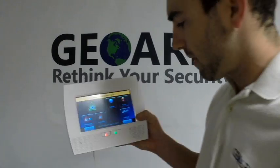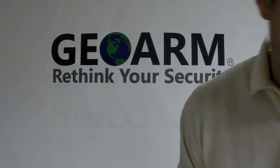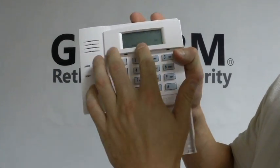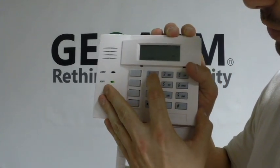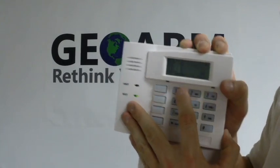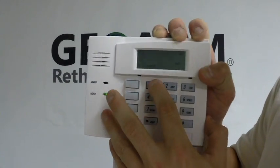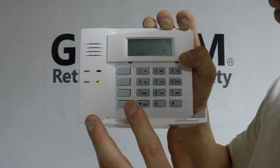So we're going to go back to our keypad, and to test this, we're going to press and hold the star button to turn it back on. As you can see, the 'not ready' is gone. Check — BAT AC is on. Now we're going to do a quick disarm on this keypad so we know that it works: 1, 2, 3, 4, off. As you can hear, it did disarm the system, so this thing is now working.